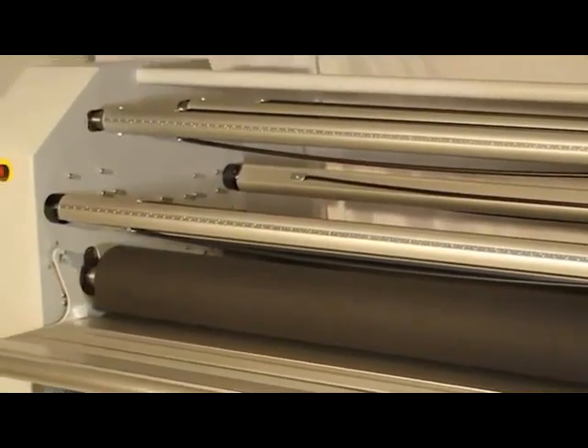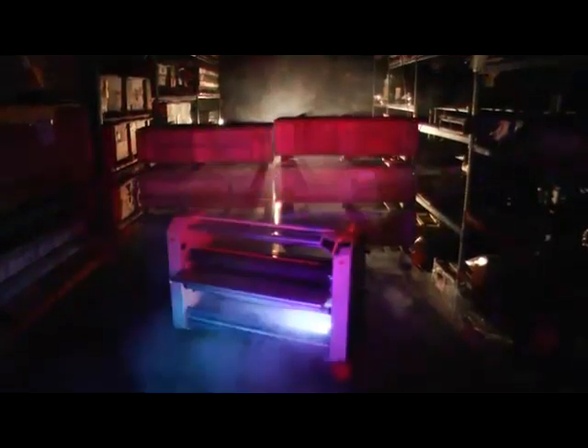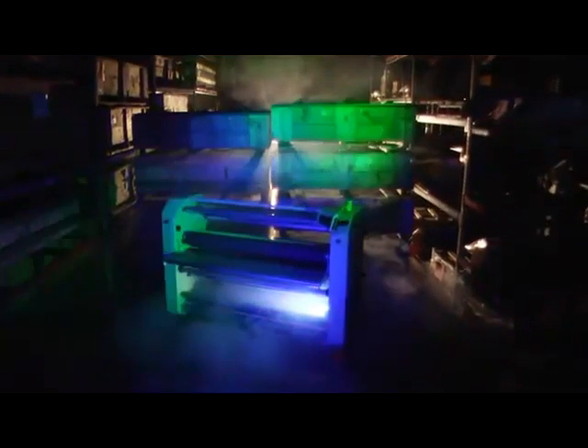In addition to the pneumatic operation of the machine, there's a lot of shafts up here. There are actually eight different shaft positions, and they're all very important. There are two combi shafts, four supply shafts, and two take-up reels. That allows you to do any application you want in this particular machine, hot or cold.